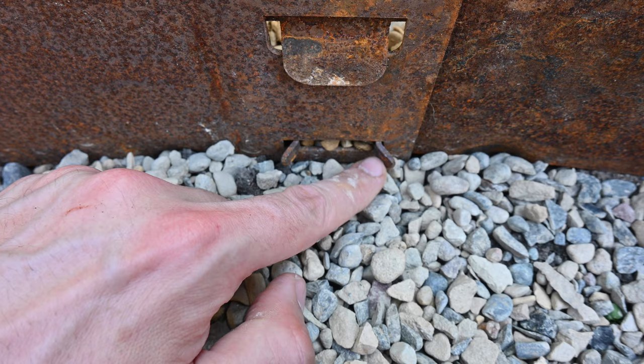All the gravel has been laid over the path now, and you can see it's nice and level from the start to the end of the path. I've used just a long brush to spread the gravel level — it does try to go to the edges, so I've moved it into the centre as well. Then I'm going to walk over it and use the tamper gently to bind it down a little so it connects together. In terms of the gravel, I've used a golden angular gravel, the 10mm version. You can get 20mm as well, which some people prefer as it's less likely to get in your shoes, but I like the feel and look of the 10mm.